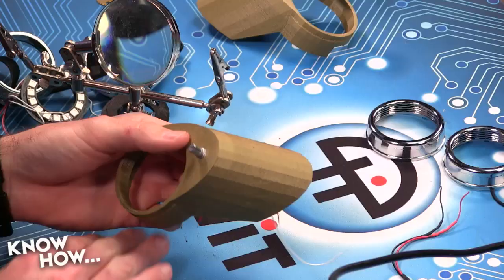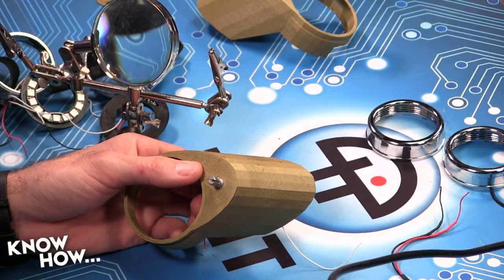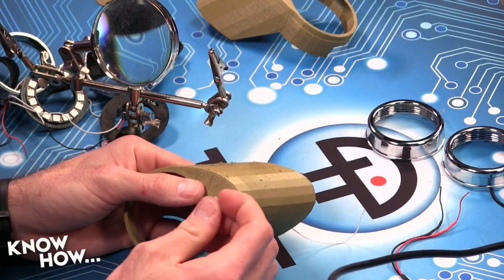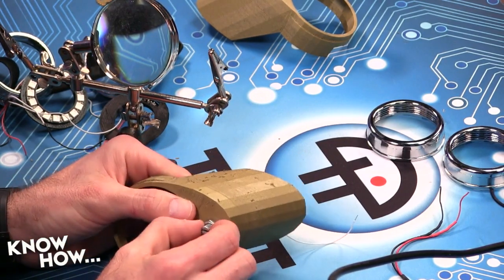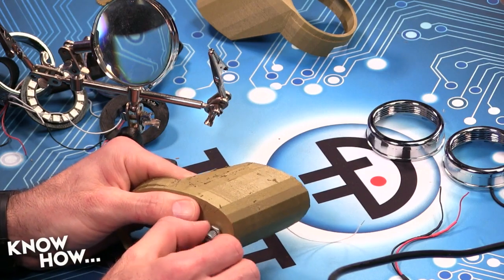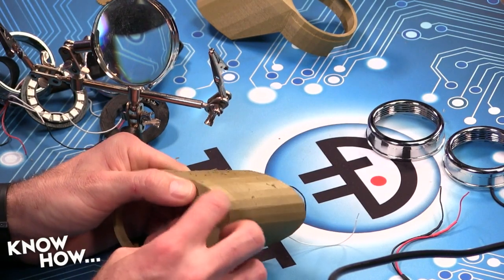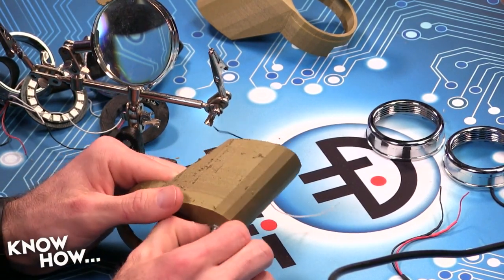So I've got my potentiometer. I've got the nut and the washer. Did you use the washer when you were attaching it? No, don't use the washer because it makes it too thick. And then you put the gear on first, right? And then the nut? Correct. You want that nut to hold the gear into place. I really blew out this ring. I might do that later because I have to Dremel my little gear out to fit over the potentiometer.